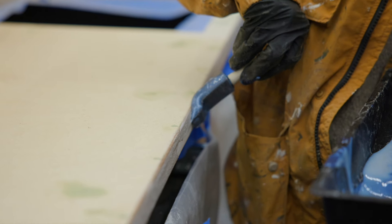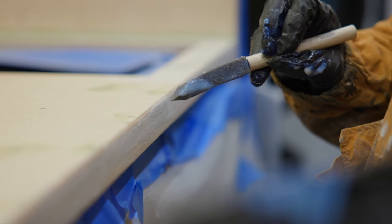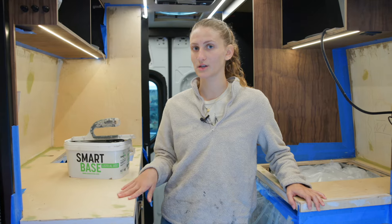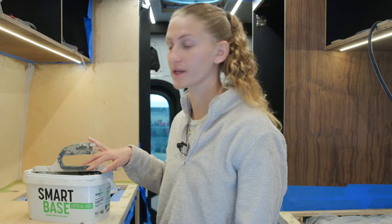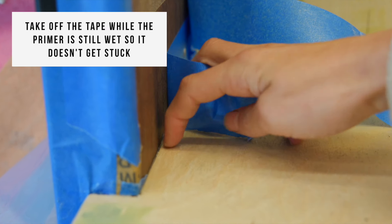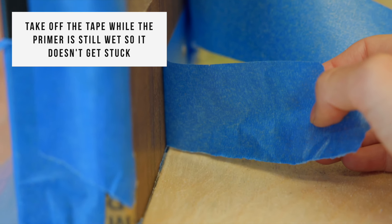The easiest way to apply the primer is with a roller, and for hard-to-reach spots, foam sponge brushes are great. They give you two rollers with the kit — one for primer and one for varnish at the end. If you're doing multiple projects, you can save the roller in a zip-lock bag and it stays wet. After applying the primer, it says to wait 30 minutes, but when we contacted SmartCrete they said actually two to three hours. Then the first layer of cement must be applied within 24 hours of the primer. The tape gets a little stuck with the primer, so use an exacto knife to remove it, then re-tape for your base layer.